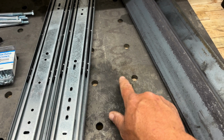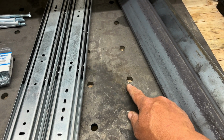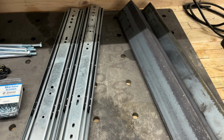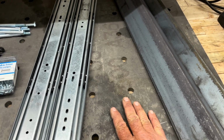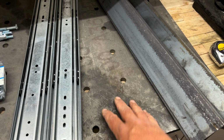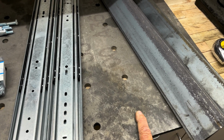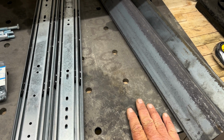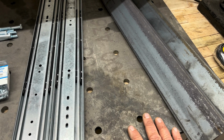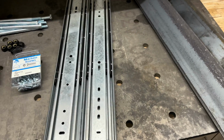They are 4 inches apart side to side, or east-west, and they're 4 inches apart north and south. And they're spread all the way out through the table, evenly spaced. Most of these layout table companies, all of the fixtures and the stops and the clamps and everything you buy require a 5/8 inch hole. So I had the laser cutter go ahead and cut everything out of 5/8, and I put 5/8 bolts in here, and they are a perfect fit. So that should be all good.